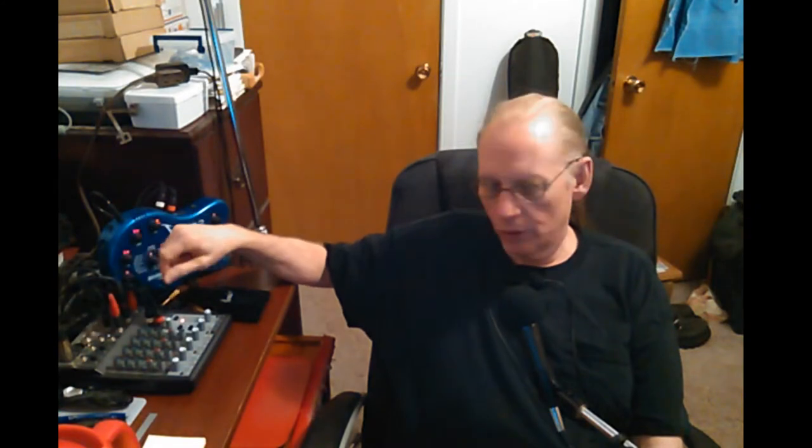What I would do to record a meeting, I would plug in a couple of extra mics, and I would either go out the aux, or use the monitor outputs to go to the recorder, since we wouldn't even be using the monitor. It depended on the little mixer. Sometimes I was using a powered mixing head, so it depended on how it was made. Sometimes I would use a tape output, like this one has a dedicated tape in and out, but I like to use the aux out, the aux sends.